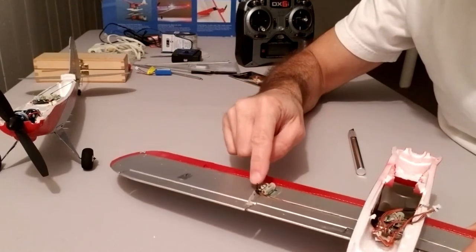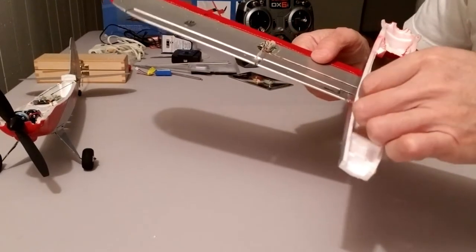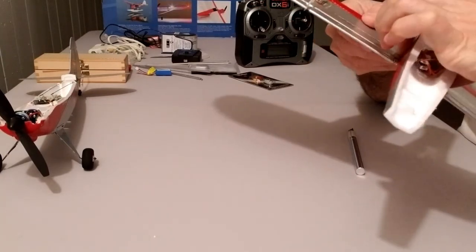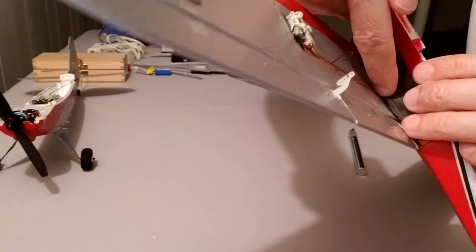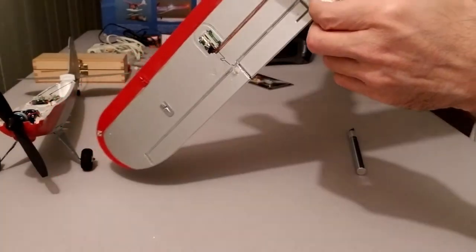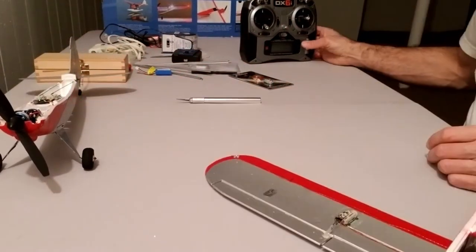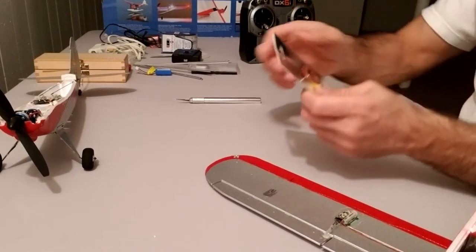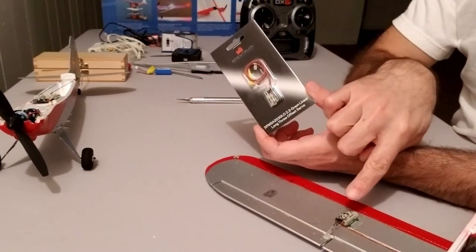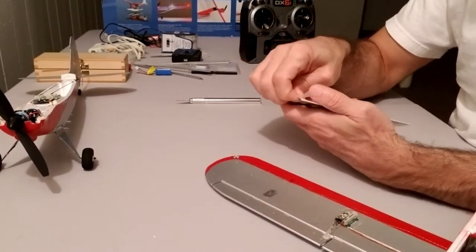I wish I could just make the connection of the wire here, but it's just one piece. I cannot do that. It's going to be difficult to pull the wire through here. So this is kind of sealed. So at this point, I think it's a good idea to test if this issue is caused by the bad servo or the controller or some broken wire or something.